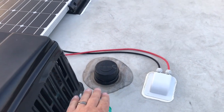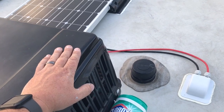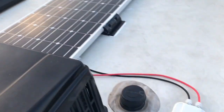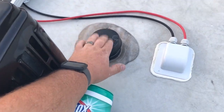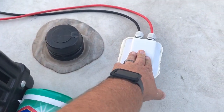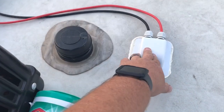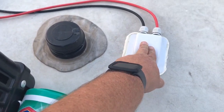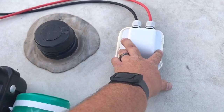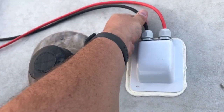So what I actually did — I'll show you how I figured all this information out. Here's obviously the air conditioner, there's the antenna, and this is the gray vent. What I basically did was just a couple inches over to the right of the gray vent, I determined where everything was. I'll show you down inside. I had to basically drill a big hole into the roof, which does sound rather scary, and basically install this flange unit here. What I did was I actually ran these two lines down below.